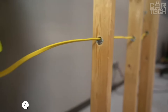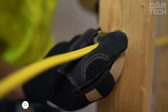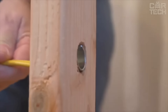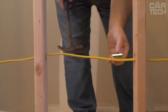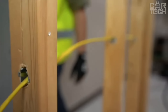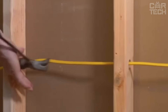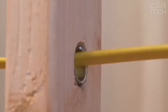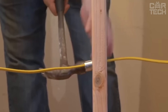The Smart Shield nail guard protects wires and cables. When renovating a home, the problem often arises of keeping nails or screws from hitting wires. It's not just a plate but an entire cylinder that protects wires from all sides — one Smart Shield does the job of several regular protection plates. It's much quicker and easier to install than regular plates: just slip it over the wires and you're done. Unlike regular plates that can bulge out and leave drywall uneven, Smart Shield keeps everything smooth. It also doesn't bend when you install it.